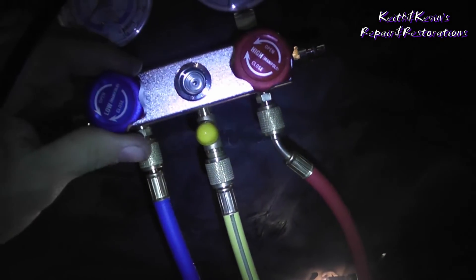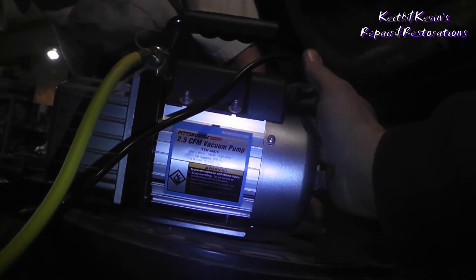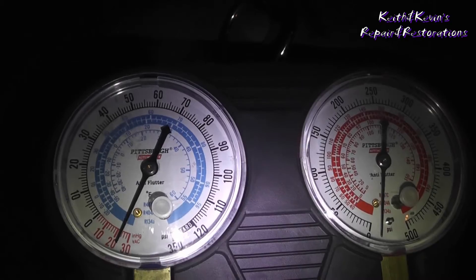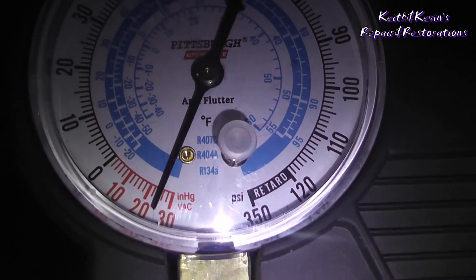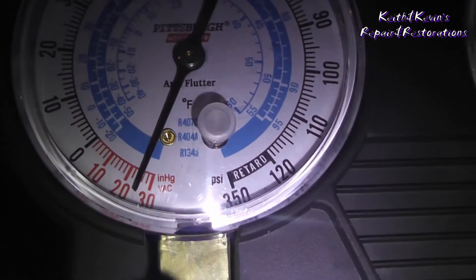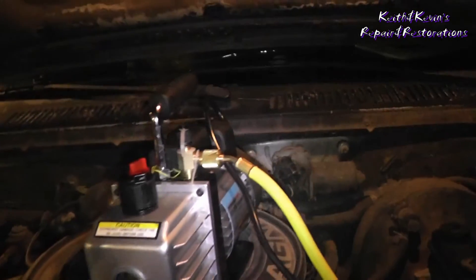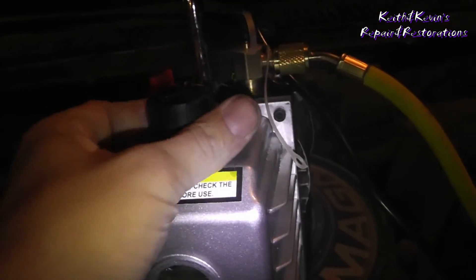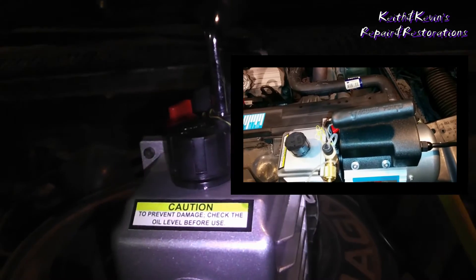Very important: open your gauges, then go ahead and start your vacuum pump. It stinks — that smells. I'm checking to see if it's drawing down a vacuum. It is — it takes a minute. You've got to suck the whole system down. Yep, they're sucking down. We're all in — about two and a half hours, we'll come back out and check. You'll see some smoke — it's actually steam. What it's doing is heating the lines up so you get your moisture out.